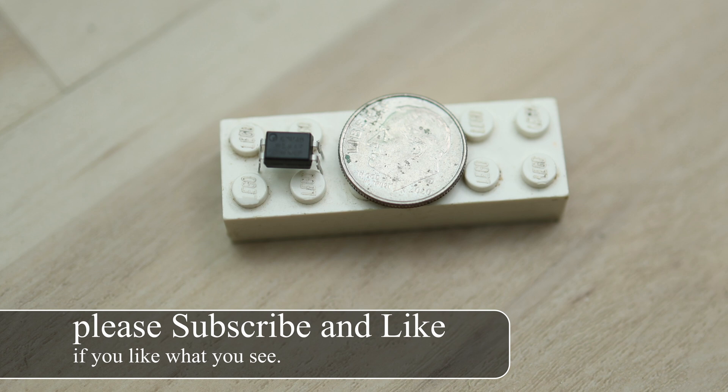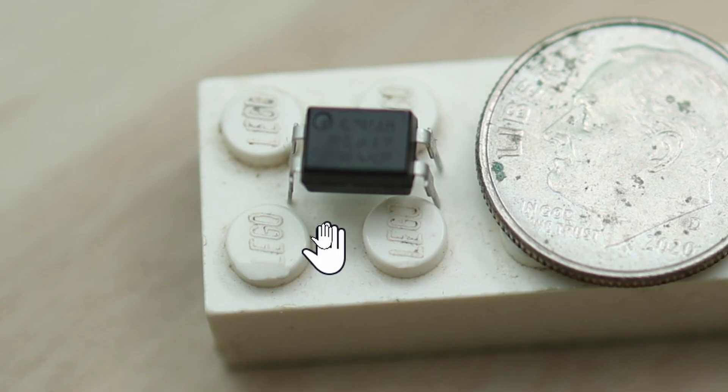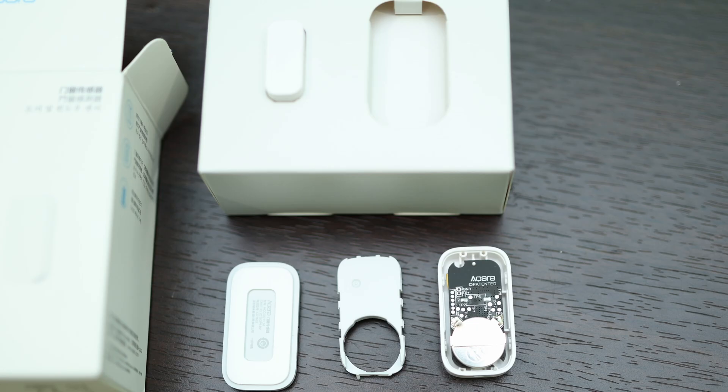There are four pins on this chip. The left two pins are voltage pins — they need three volts DC input. Polarity does matter, so if you put it on the wrong polarity just swap the two wires around. The pin nearest to the indented circle is positive and the bottom is negative. The other two pins on the right-hand side act as a bridge — by default the circuit is open, but when voltage input is applied on the left, the circuit closes on the right.